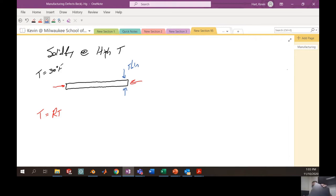So with this particular laminate, when we go down to T equals room temperature, we get microbuckling. That manifests as little waves that you see on the surface, so that it can relieve the compressive stress that is created from the cooling process in manufacturing. So we have this microbuckling effect.